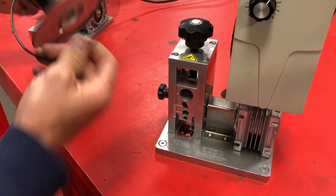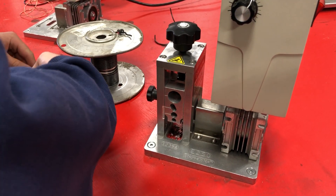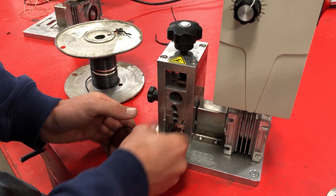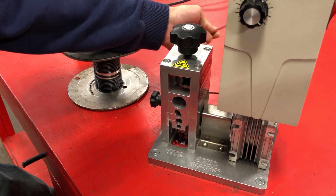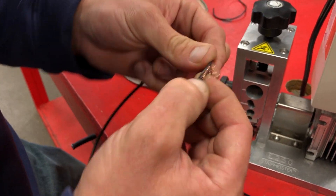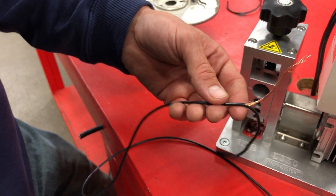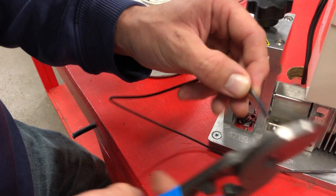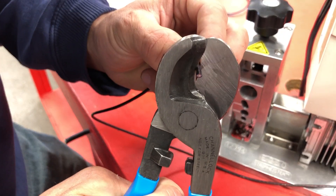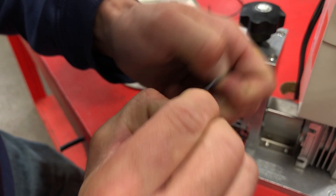Now that's our first strip piece. One of the hardest parts is getting the copper out. It started fairly easily here, but just to show you a little tip — if you're struggling to get the copper out, what you want to do is strip this cable as if you were going to terminate it. Now you have this piece to pull out.